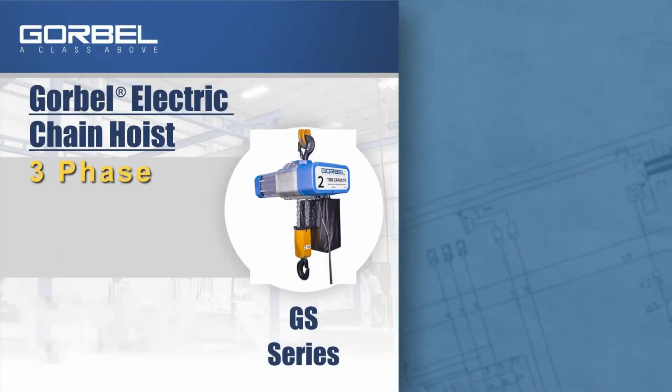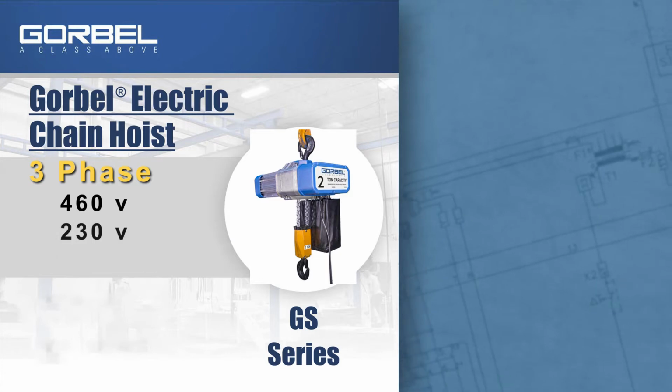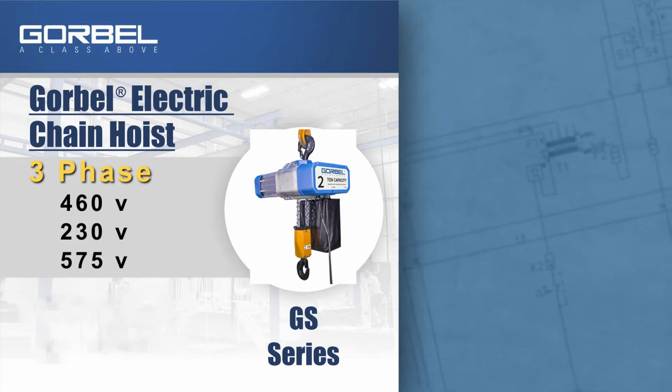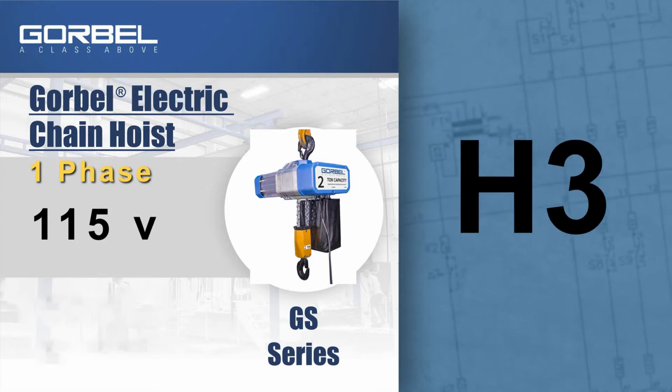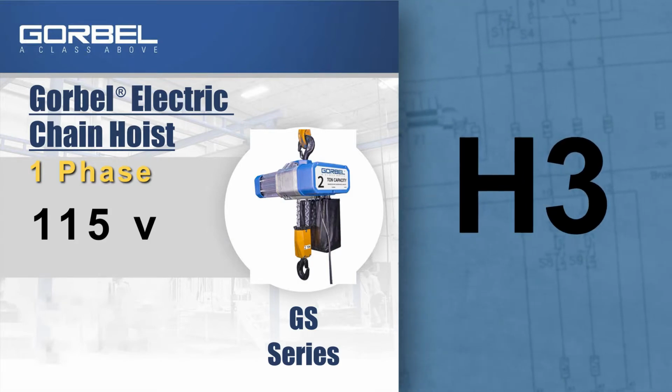All of the 3-phase hoists, which include the 460, 230, and 575 volt hoists, are all H4 rated. The 115 volt single phase offering is H3 rated. So you'll hear a theme throughout the entire presentation, and we'll focus on the quality of this hoist offering. The GS hoist is a German designed, German manufactured hoist of very high quality.